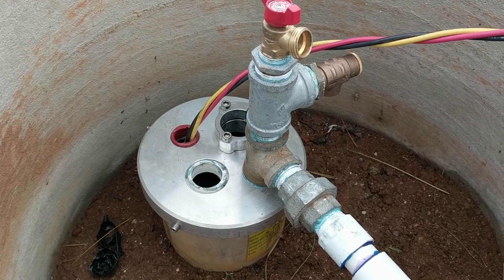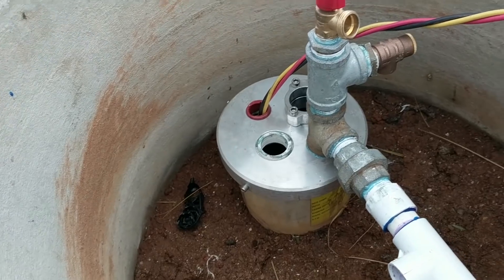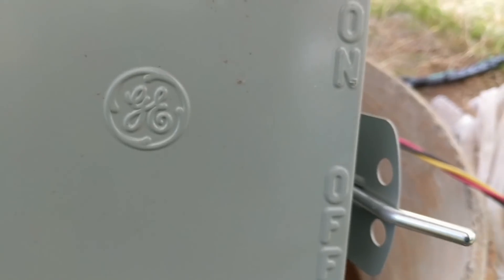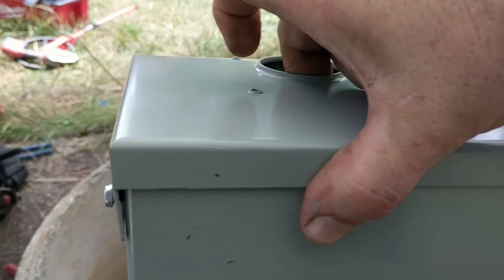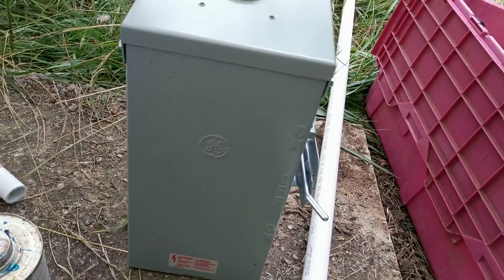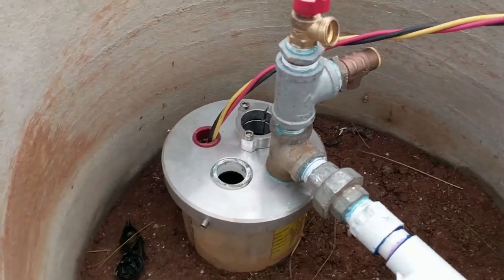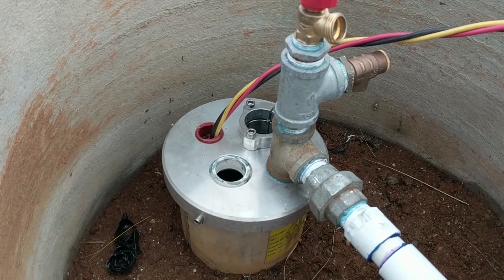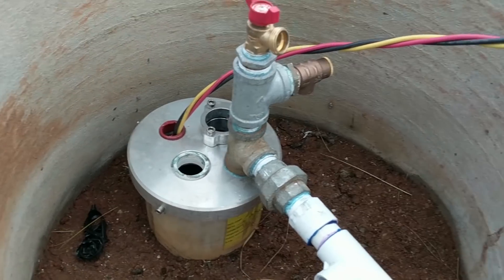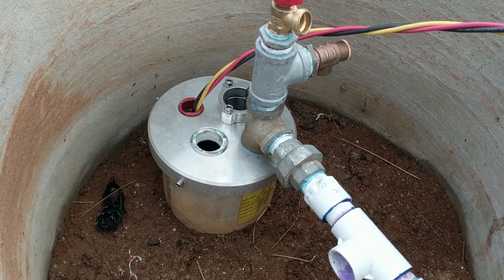The whole reason for all this is to stop the dimming in his house. We're going to have this — just a relatively inexpensive safety selector switch — that we can switch and select between the two pumps. So we're going to be able to select between Grundfos and Franklin in this well. We've got a little competition going on: Grundfos, Franklin, and simple pump inside this one well. The soft start will take away the dimming, and it'll also give him backup so he can run either pump.